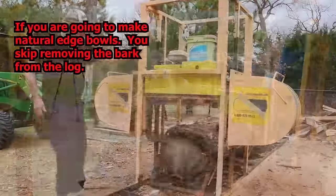First, we have to do something. We've got to take all 22 of these blanks, and just for convenience, stack them up over here on my jointer so they're stacked by size, because we've got to change this pin every time we change to a different blank. So we're going to do all the 6 inches first, and then we'll do all the 8 inches and so forth. We'll do them in groups. Saves time. Remember that a big part of this is not only to get a better quality blank, but we're going to be turning out a lot of really high-quality bowl blanks very quickly, because we can make these go through here quick once we line things out.